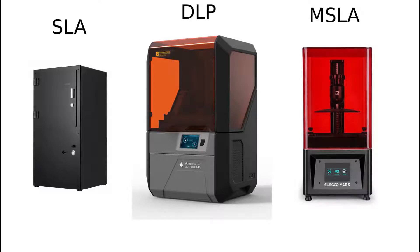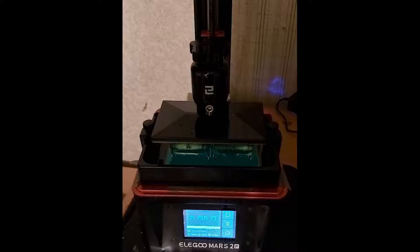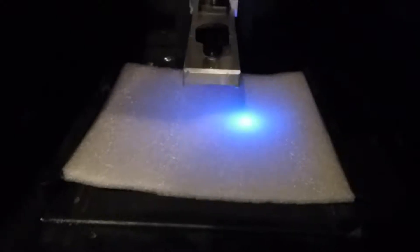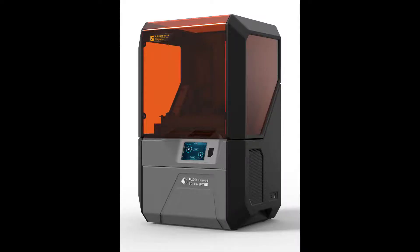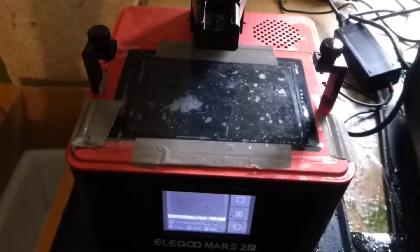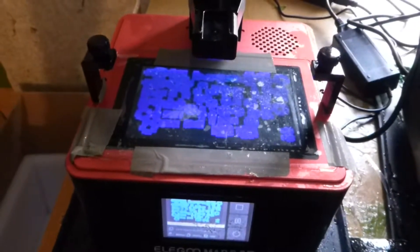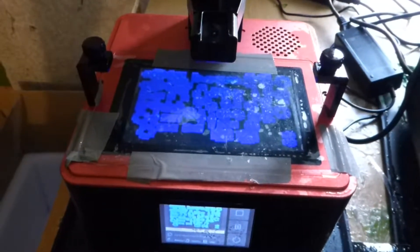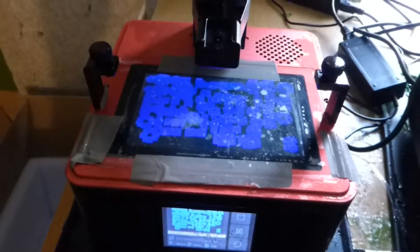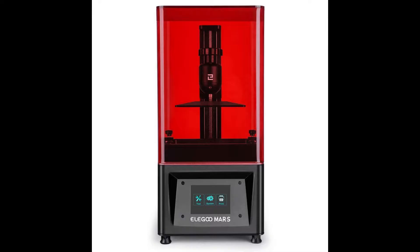What is SLA, DLP, and MSLA? SLA, DLP, and MSLA printers cure resin to build up a print, so for simplicity I will be calling them resin printers. SLA uses a laser beam moving back and forth, reminiscent of FDM. DLP uses a projector to cure each layer, masking off the areas you do not wish to be cured. MSLA does something similar to DLP but uses an LCD screen to mask off the areas and a UV light to cure. Out of all of these, MSLA is the cheapest and what I'd recommend for the hobbyist. However, it may be marketed as DLP or SLA — that is marketing, not how it actually works. More information in the description.